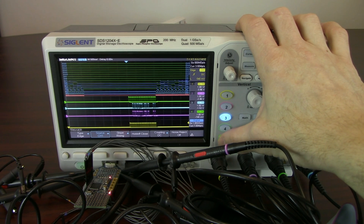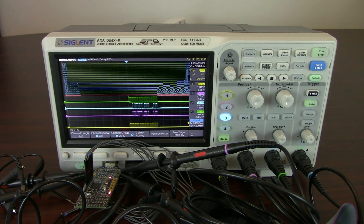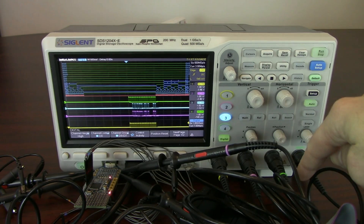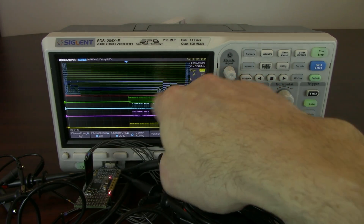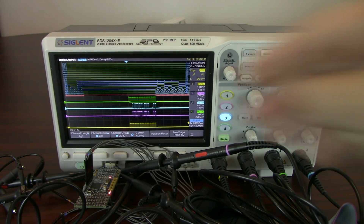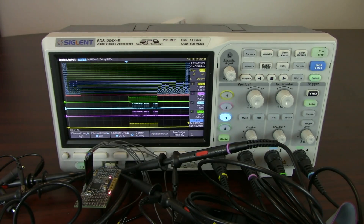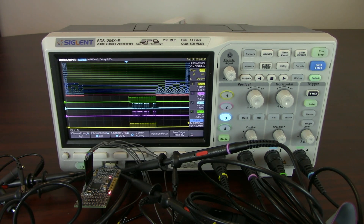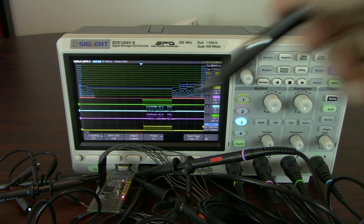To turn on the digital, we're going to press the digital channel key here. Once we've enabled the option and installed the hardware, you can see we've got all four of the analog channels up here, and we're also showing all 16 of the digital channels. Because of the board we're using, we're actually only seeing eight moving values since I don't have the other eight connected, but we are able to actively measure all 16 channels as well as four analog. Some competitive oscilloscopes don't have that capability and actually lose analog channels as you add banks of digital channels.